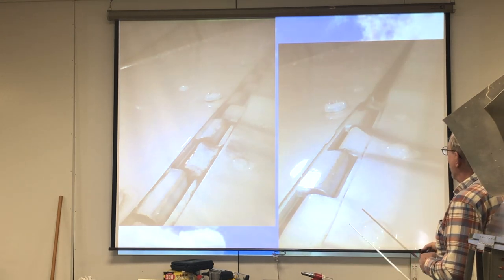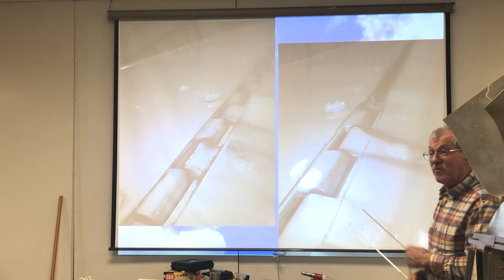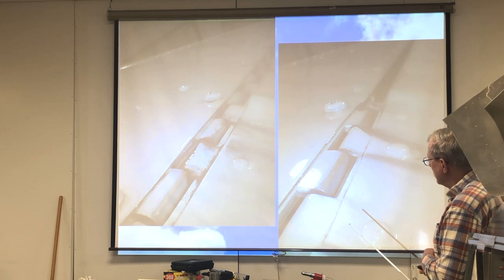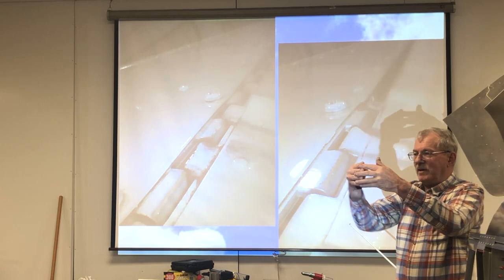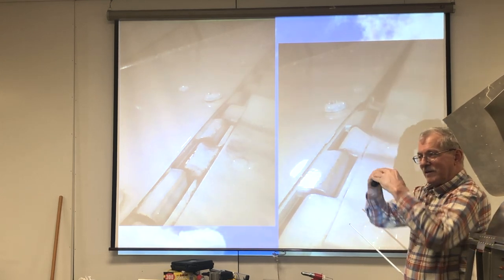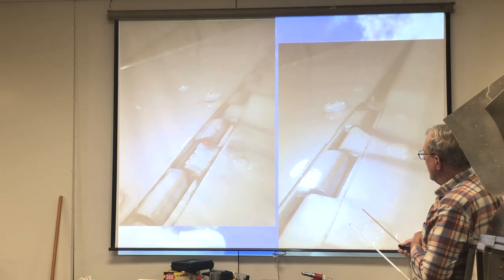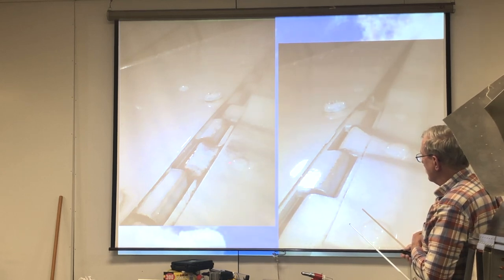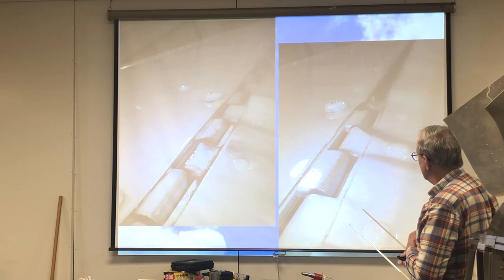Your flaps are held on with piano hinges like this. Now, this is off a Cessna 172 that we have in the shop here right now. You see all this black stuff right around in here between these hinge segments? This is called a piano hinge. It's got fingers like that on it and a wire between it, and it goes back and forth, and so the aileron goes up and down. However, there's a stainless steel hinge pin in there, and these two segments of this aluminum hinge piece attached to the aileron and this aluminum hinge piece attached to the wing, they're just rubbing themselves together.